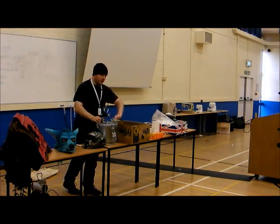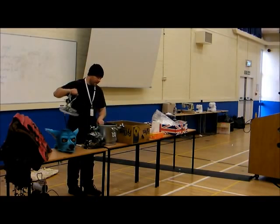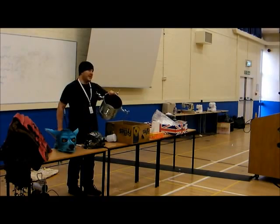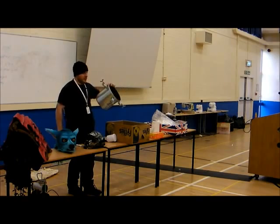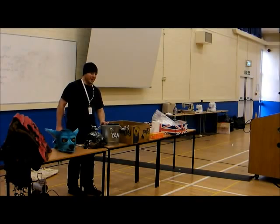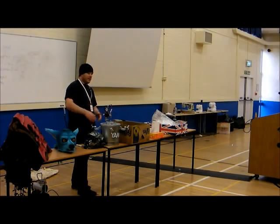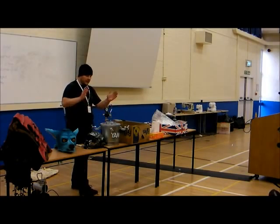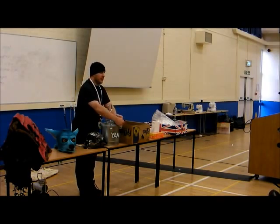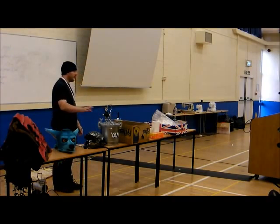So basically what you'd do is you'd open this guy up, pop the lid off. Inside, it's just an empty thing, it's no magic. I made a little base because it's got a little round base, which was a bit annoying to put moulds in. Polyester resin in there. You can smell that. So you put your resin mould in, everything, close it up, screw it up, attach it to a nice big compressor, fill it up, close it off, leave it, walk away, leave it for a few days.